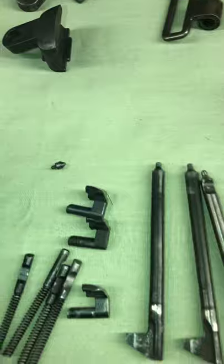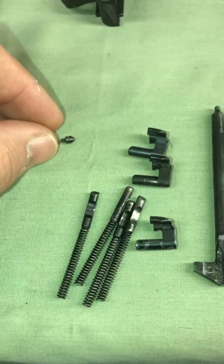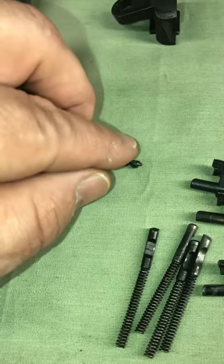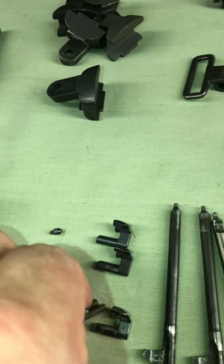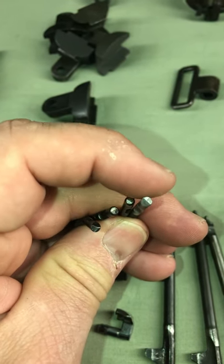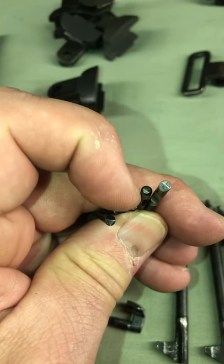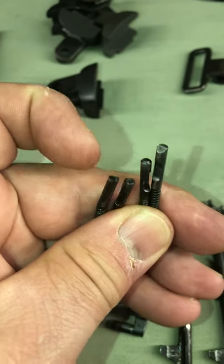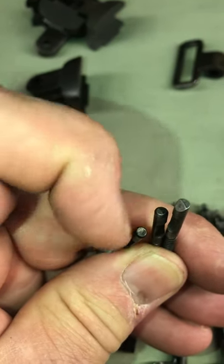On the bolt, this is a normal extractor plunger because it has the flat part. If it's rounded and that's all it has, that's type 1. There are four different types of ejector plungers. This one here has only two faces — it's probably early. This one is type 3, which is round with a heavy bevel. Type 2 is round with a light bevel. And this one here is 3-sided, which is the earliest of them all.